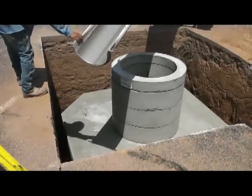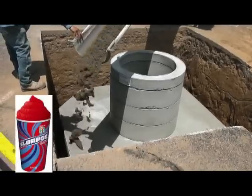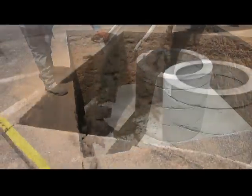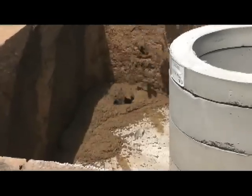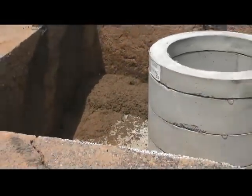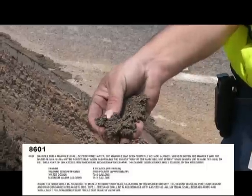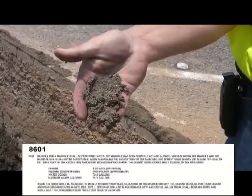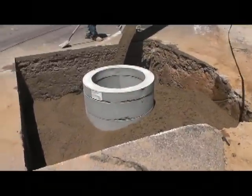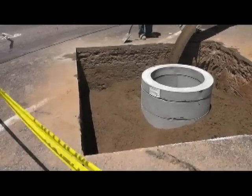We're just about done. Now it's time to add some slurry — and no, not a slurpee, slurry. Slurry is made up of a coarse sand and concrete mix. It's used to backfill, and it will help keep the manhole in place and keep it from shifting. If you check your spec code 8601.30.6, you'll see it's made up of cement and washed concrete sand. When it dries, it dries hard, but not as hard as regular concrete. They will backfill about 95% of the hole with slurry. The rest will be gravel that will serve as a base for the asphalt patch.